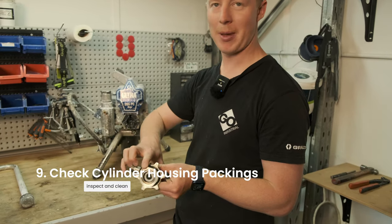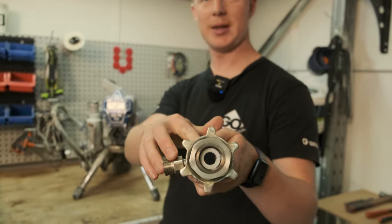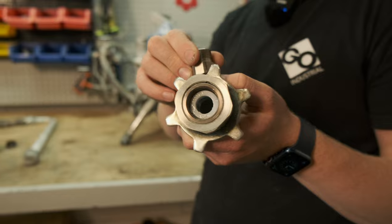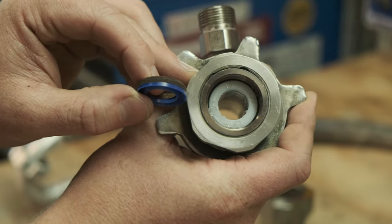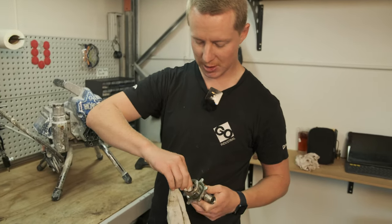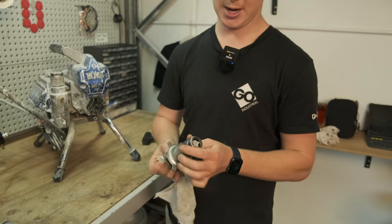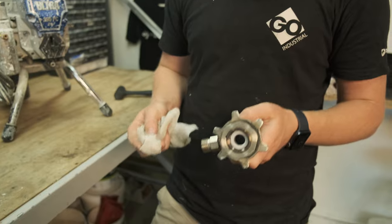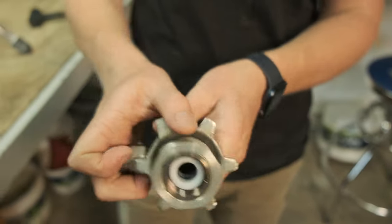Next step is to check the upper packings and the top side of the pump. The main thing you're really looking for is a warped packing down the bottom section of those packings — as long as they're all fairly even, they're okay. Also, the colour of them is a dead giveaway: you want them to be fairly blue and fairly black. There is a little bit of discolouration, but that's normal as the piston strokes up and down. Just make sure they're clean by sticking a wet rag through and twisting it until it pops out the other side — that'll clean the inside of those packings. Then just give these threads a bit of a wipe to make it easier for everything to move.